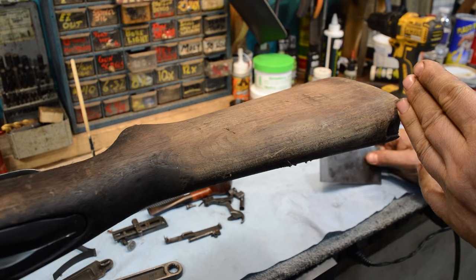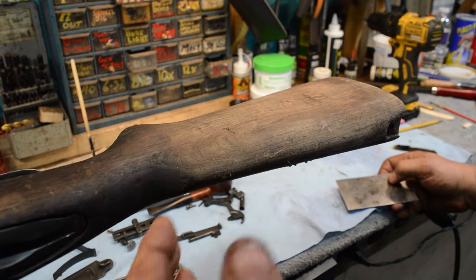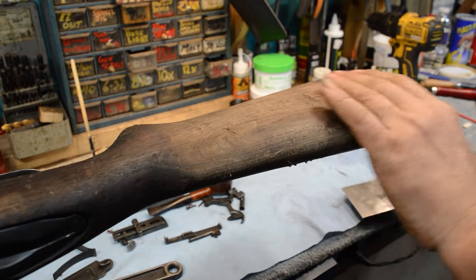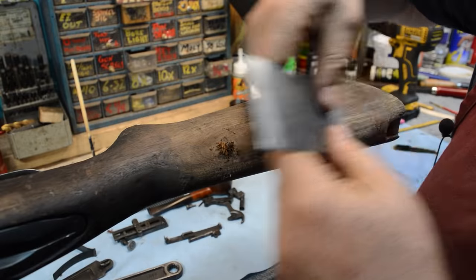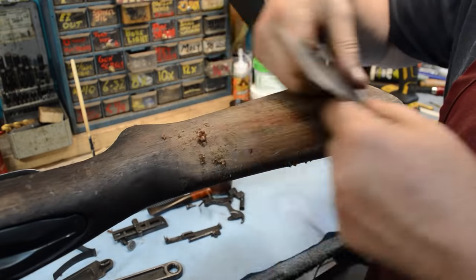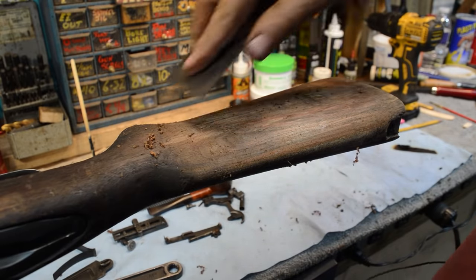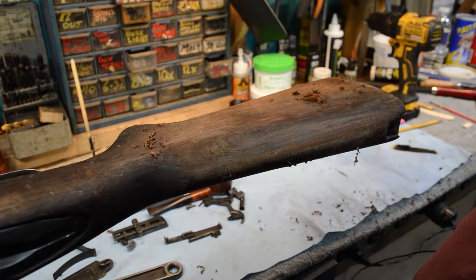We've immersed this in lacquer thinner for about 1 minute per decade. So in this particular case, about 8 to 10 minutes we've immersed this. And you can do this without 5 gallons of lacquer thinner by soaking a rag in that stuff and wrapping the stock in it for a little while, 10-20 minutes. And then when you take the rag off, make sure you put the rag somewhere and let all that volatile stuff pop out of it. So we did that, and we removed a lot of the oil in this stock, and you can see it's cutting much easier, much more freely. Lacquer thinner and chemicals are not everyone's cup of tea, but I will reemphasize that if you use caustics or you use a petrochemical, whatever you use on a stock, once you use it, you have committed to refinish the whole thing.